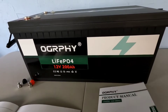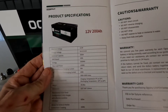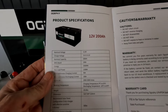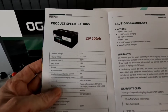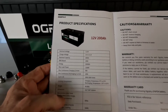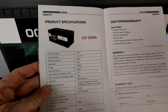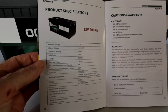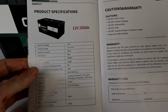This battery has a 100-amp BMS and comes in at 50 pounds. Nominal voltage is 12.8V, capacity 200 amp-hours, total energy capacity 2,560 watt-hours, max load power 1,280 watts, max continuous charging current 50 amps, max continuous discharging current 100 amps. They recommend a solar configuration of about 600 watts to charge this up in a full day — about four and a half hours. For testing purposes, we are going to hook this up to a system and connect it to some solar.